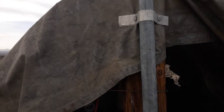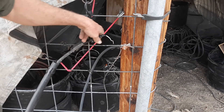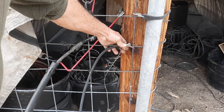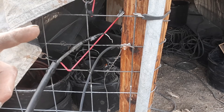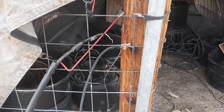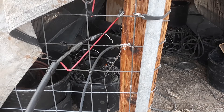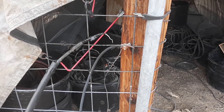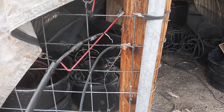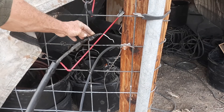That's a lot of energy for a little solar system. Excuse the mess — this is all thrown together from recycled materials. One problem I had is you need a very solid wire going from your turbines to your battery bank. I've got at least a hundred feet of distance between where these turbines are mounted and where my battery bank is. When I had thinner wire, the turbines would just trip out all the time saying voltage is up, because of electrical voltage drop in the line.